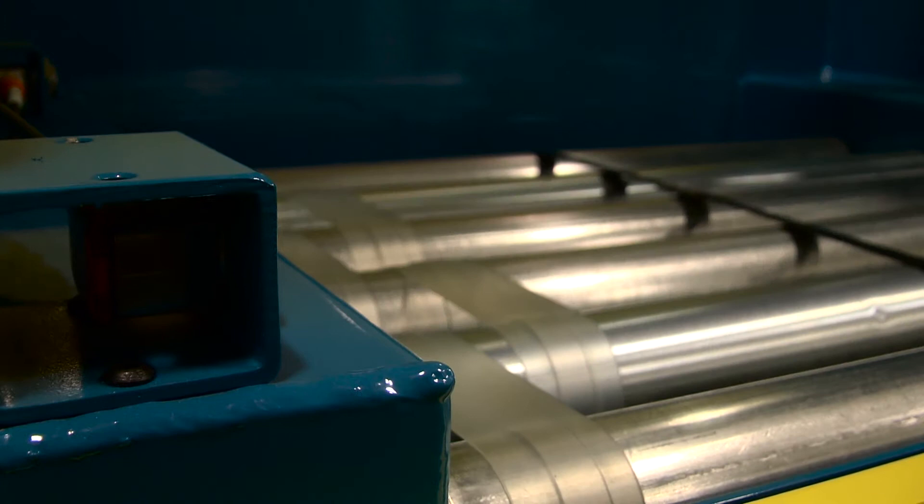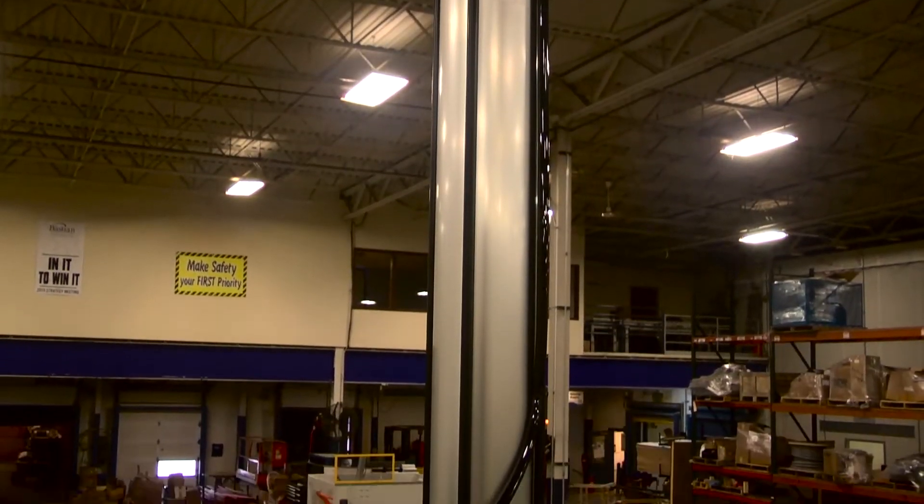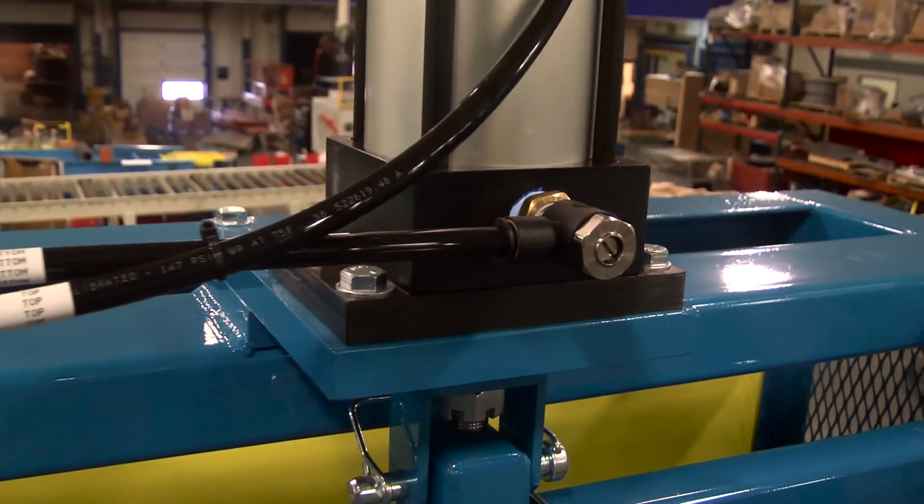Fashion Automation Engineering offers a variety of vertical reciprocating lifts. These lifts typically feature a single conveyor carriage that is actuated between two or more distinct elevations. For this particular application, we use a pneumatic powered lift elevator.